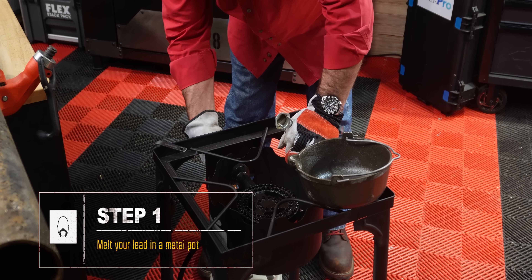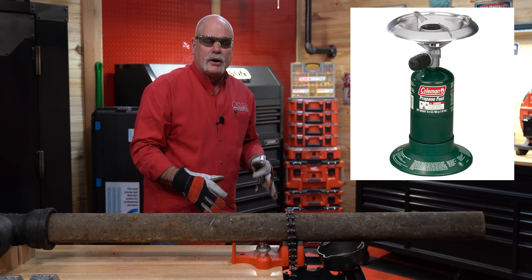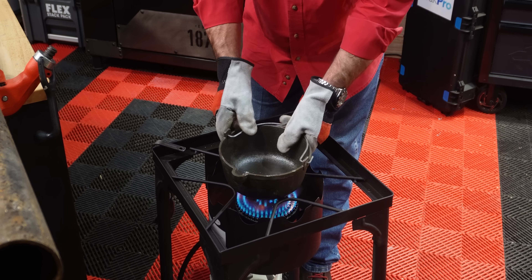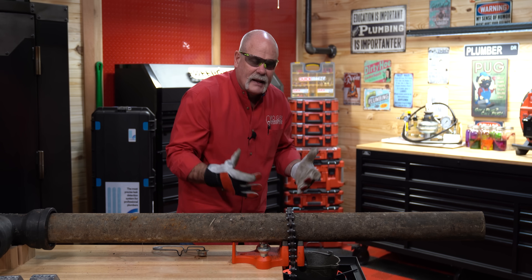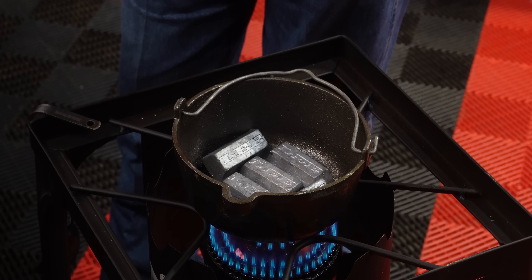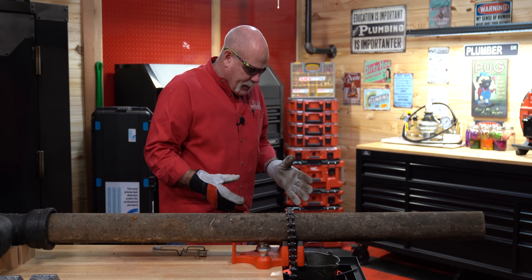When we get over here you can see we've got everything here. We're going to go ahead and turn this valve on — we've got a little fire there. I've taken a burner for a fryer and set it up. I've got my gloves on and my safety glasses on — you want to be real careful working around lead. Let's get some lead in here and get it melting down. You always used to keep your lead pot about halfway full so you could get your ladle under and skim the top off to get good clean lead.